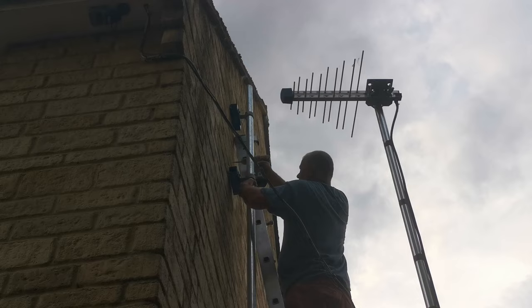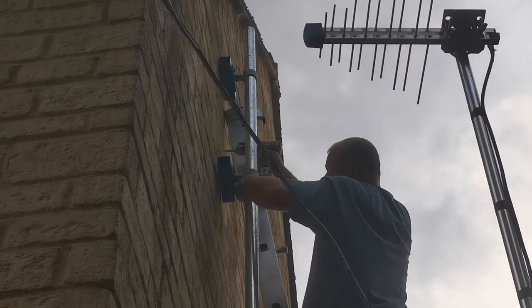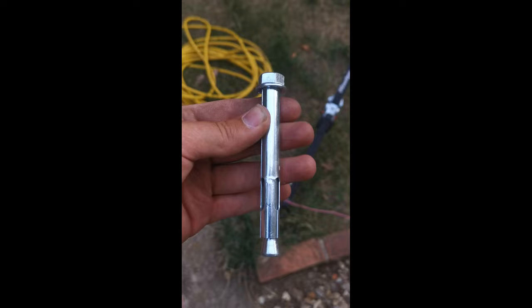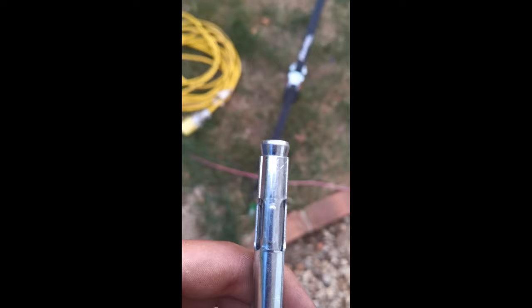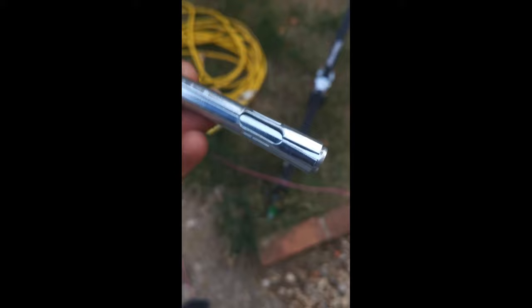This is probably going to be the cable we use to go from the windmill — just a bit of 110-volt cable. These are the wall anchors we're using: they've got a nut on the end and as you tighten it, it pulls this wedge-shaped bit in, causing the metal to splay out. If I do it up you can see the gap getting wider — the tighter you do it, the more it splays out.